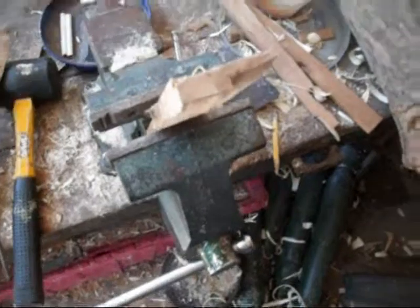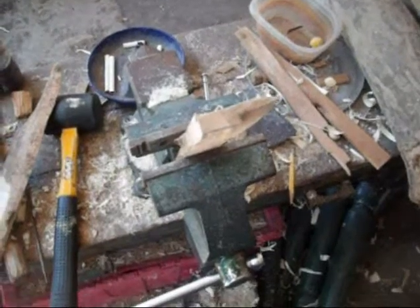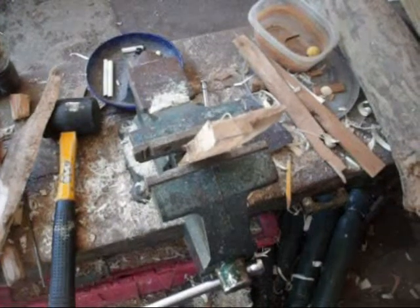I'm going to show you how I'm going to make a wooden wedge for this. I've got a couple of pieces of hardwood over here drying out. Take these and lock one into your vise, and then use any sort of blade — you could use a knife even, but I'll use my draw knife here — and just hammer off a wedge and it'll split away, taper down to nothing, and then you can trim it to size and pound it in there. We'll show you this once it's hung.